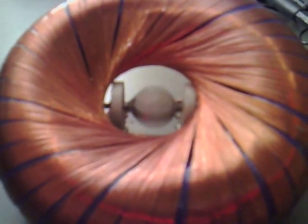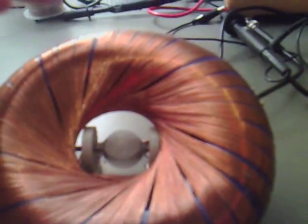I find that quite interesting - it can be used as a motor. I am sure it can be used as a lot more things than that but it's very interesting. I think I am going to do a few more experiments on this. For one, I want to get three more frequency generators - I am going to have to set up some pulse width modulators to go through the other coil up here and the other coil down here, and I think that we will be able to control this in an exact fashion, which I think is what we are going for.